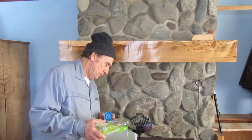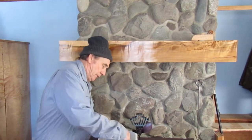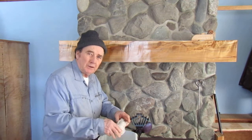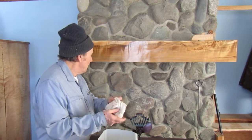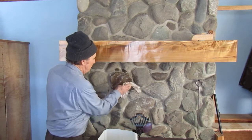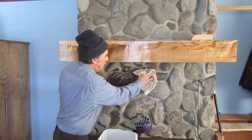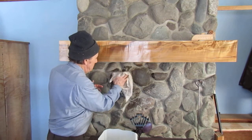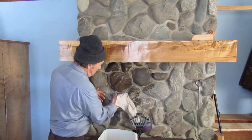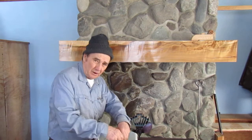You've probably heard about using muriatic acid on masonry. They do use it, but we don't. What happens with muriatic acid, especially outside, is it keeps working long after you're done. Over a period of time — maybe 15 years or so on the outside with southeast exposure — it will eat the mortar out of the joints. It takes a lot of time, but it does happen, so you have to be very careful with muriatic acid.